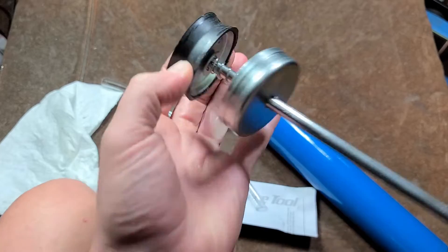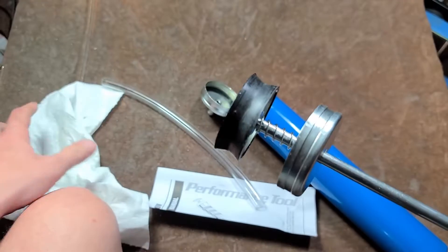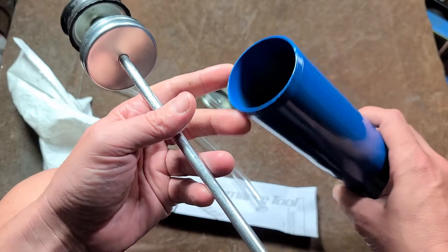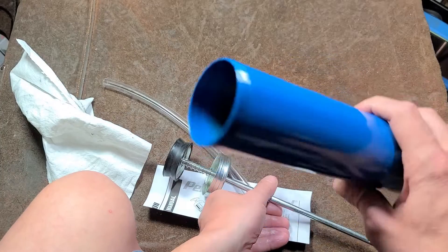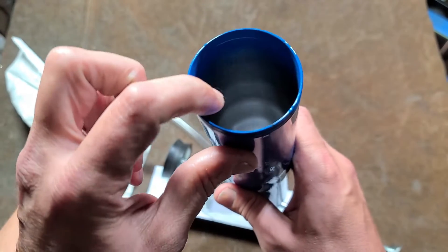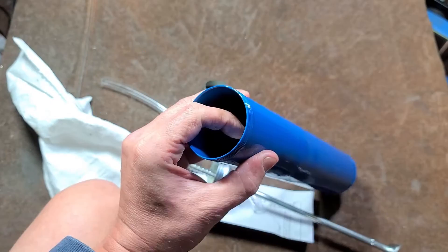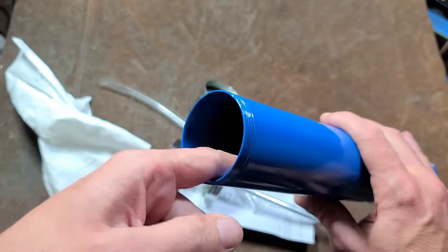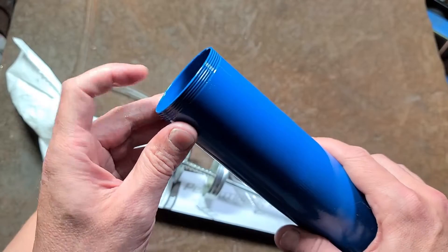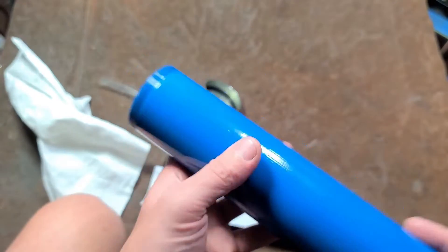This is a surprisingly dirty tool right out of the box. I find it interesting that I'm getting black material off the seal — that might indicate a compatibility issue from the lubricant they're using to pre-lubricate it, if it's dissolving any of the seal material. This does just seem like rubber, not urethane or anything like that, and it does have a degree of odor — it kind of smells like a bicycle tire. The tube has a lip on the output side but not on the input side, so you'd want to keep track of that. The bore looks like a powder coat, something pretty durable. But you can see some paint droplets midway down the transition into the bore that could act like a mild abrasive against the soft rubber seal.